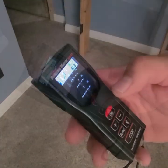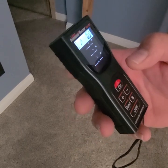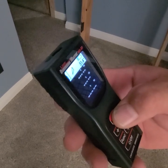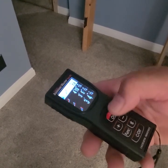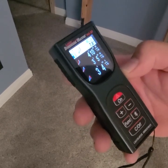The advanced indirect height partial requires you press the function button until the skewed triangle icon displays. With the laser on, press the on button to measure the first diagonal and its corresponding angle. Then measure the second diagonal and its corresponding angle to calculate the height. The height will be outlined in red when the calculation is complete and will display at the bottom of the screen.